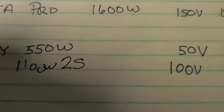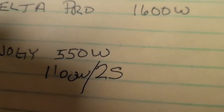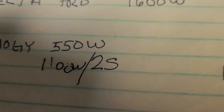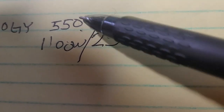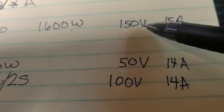In the advertisements, panels are given a watt rating under laboratory conditions — a set amount of light energy striking the panel at a perfect angle and a temperature of around 72 degrees Fahrenheit. So it's under perfect lab conditions. This panel would get 550 watts, and in some situations might get more, but in real-world outdoor use it'll get less. The two panels together would add up to 1100 watts maximum. Today in bright sun with the panels tilted near perfectly, I hit 1000 watts — I've never come close to 1100 and wouldn't expect to.